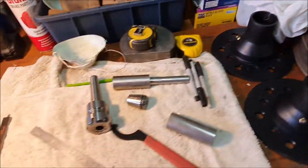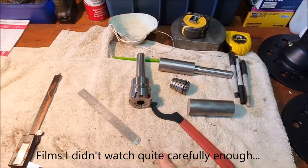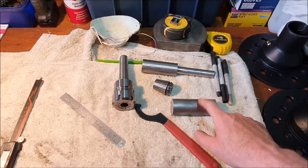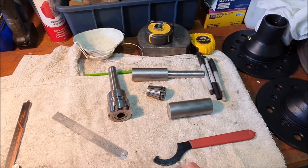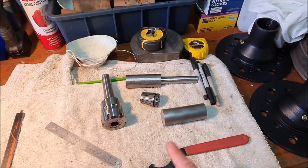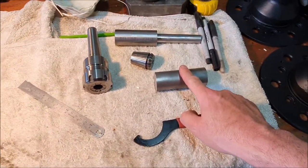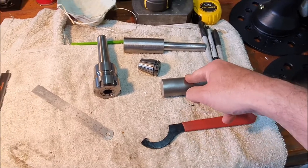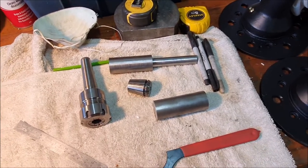They're pretty simple — I drew up a quick sketch of what one looks like and there are plenty of videos on YouTube showing how to make them. So I'm going to make one to fit in the little collet chuck for the mill. It'll be a fun little thing to make and I can try it out on some scrap aluminium and steel to see if it works, and if I'm confident enough I might as well use it to take the fraction I need off the front cover. I've got some mild steel bar, about 36 millimeter diameter — I cut off a chunk and I'm going to machine that up and start making this little fly cutter.